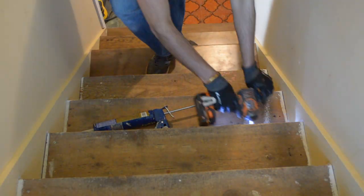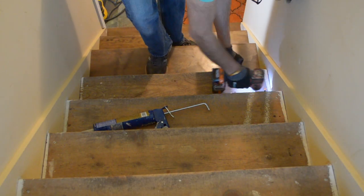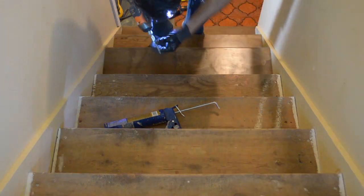There were a couple floorboards that had an audible squeak to them. To fix this, we drove in some screws from above into the wood supports beneath.